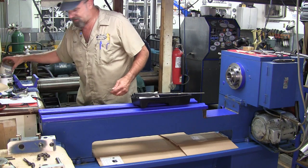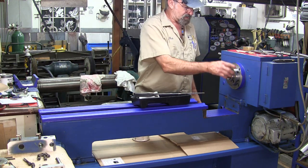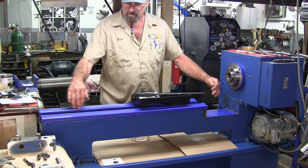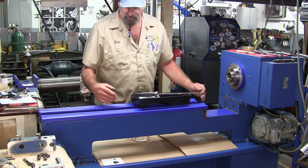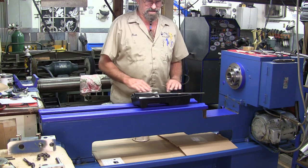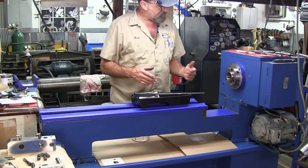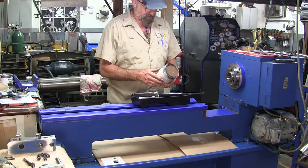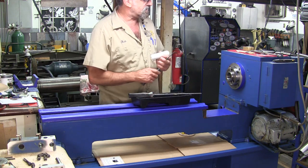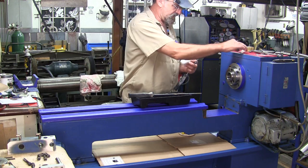Okay, we're ready to start getting some paint on here. We've wiped it down, blown it, taped it, got it trimmed. I got this down here so that runs and drips don't get into the center of the bed and inside the bed. I'll do the tray at the next step after. How are we going to paint this? We're going to roll it on with foam rollers, and I do have a one-inch throwaway paint brush that will get into some areas.